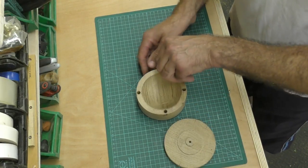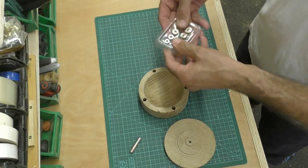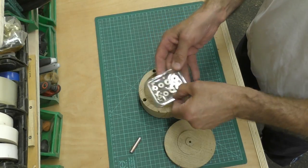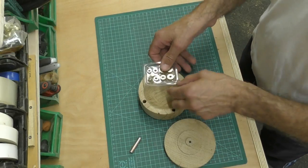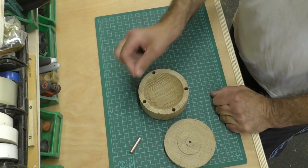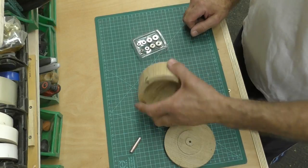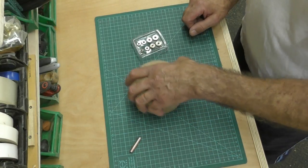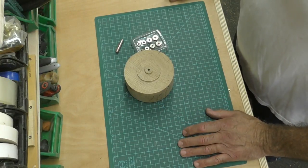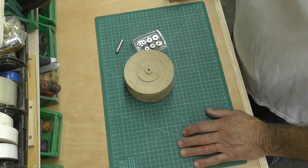So I have to say the best method — or best two methods — are either using the dowel centre finders, the pins, or indeed the little panel pin that you hammer into one and cut off, leaving a little raised piece to mark on the lid. I hope you found that of interest and it gives you some food for thought. Thank you very much for watching. Don't forget to subscribe, and I'll see you very soon. Cheers.